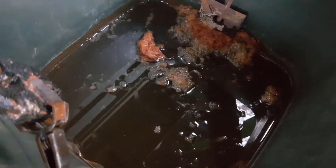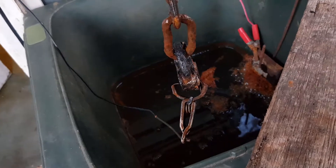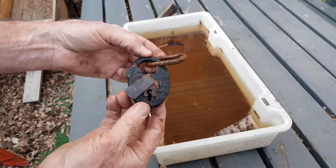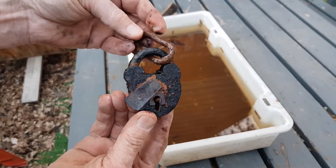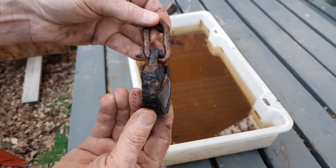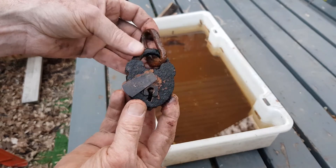The water itself has got quite murky — a lot of rust bubbles around the anode — but it's been working well. So we'll scrub this padlock up and just see if we've managed to save it and create something actually saleable. Before I start scrubbing, let's have a better look at it. You'll see this top link, which I didn't connect — it's just a normal rusty color — and it hasn't turned black like the padlock body did, because there was no electrical connection to the link. If I did want to clean that as well, I would have had to run a separate wire.